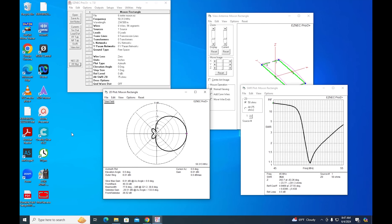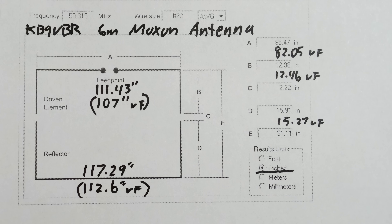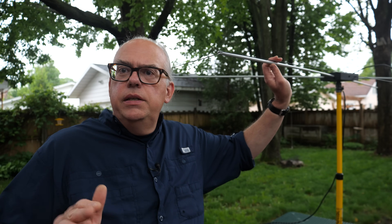The key in building a wire antenna is to subtract some wire length for velocity factor. The velocity factor is the difference between the actual length and the electrical length of the wire, and it can throw off your resonant frequency. To correct for it, you'll need to shorten the antenna a bit. With most PVC-insulated wires, the velocity factor will be 96% — or 4% shorter than actual length. I like to cut the wire to actual size and then use the excess wire for tie-offs and minor corrections. Keep watching to see where I went wrong and what I did to correct it.